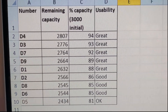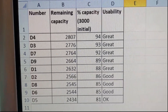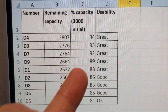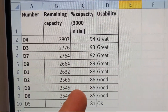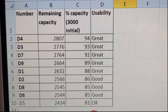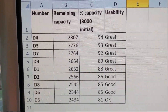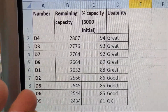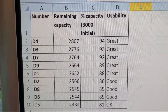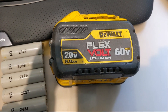A lithium battery, when it goes under 80%, is marginally still usable for battery charging boxes but no longer for power tools. The first five are great — almost 90% left after six years of using the battery. This is fantastic. These three are still good, over 85-86%. 81% is still over 80%, still usable. So eight of them are absolutely reusable. The ninth one I'll use if I need to, but I'll rely on the first eight. Success in recovering at least eight cells out of 15.